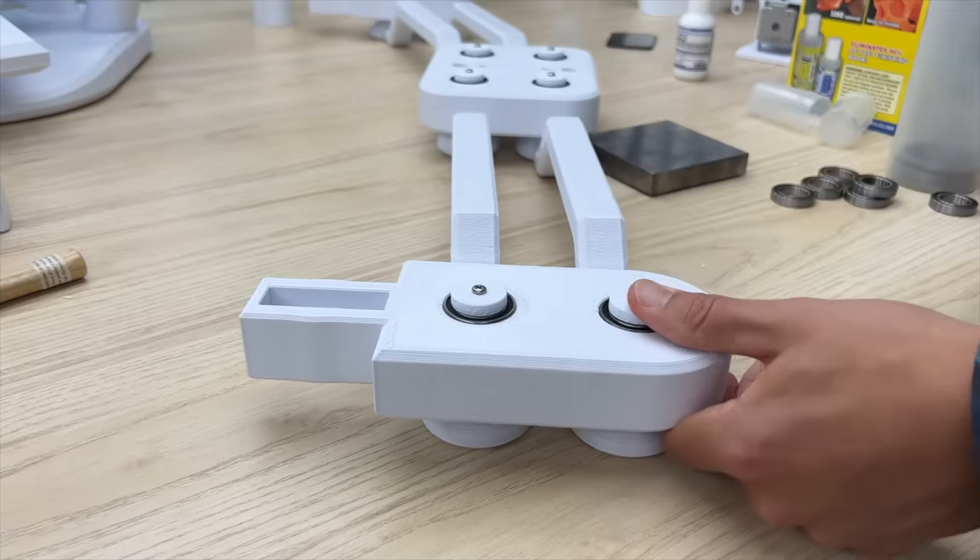Finagle I did — starting by taking the entire thing apart and coating the inside of the slider sleeves with some polypropylene tape, which made a surprisingly big difference. Next, I grabbed some bungee cord, drilled some holes into the arm pieces, and strung the bungee cord between adapters which I screwed into the holes. This was to counterbalance the weight of the arms so they wouldn't drop as fast. Once everything was strung up, I put the arms back onto the sculpture. A little too much bungee — snip, snip — and it's perfect.